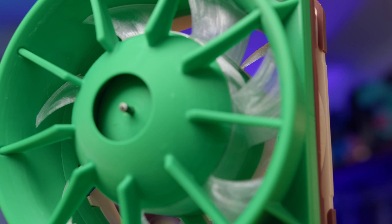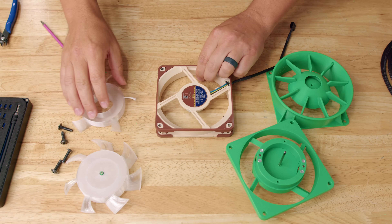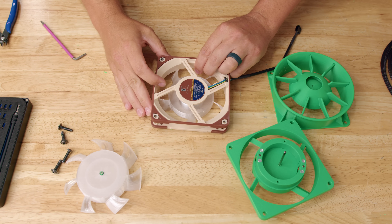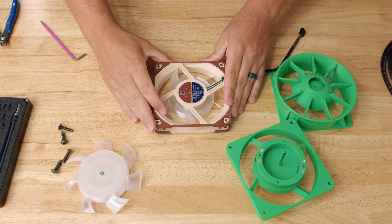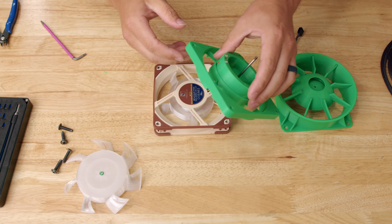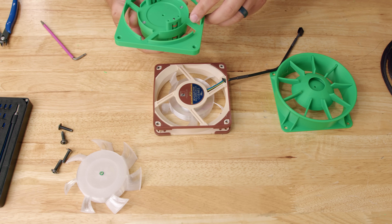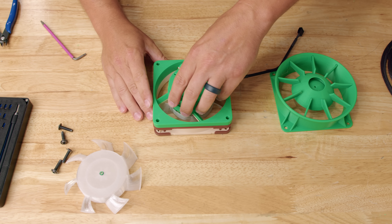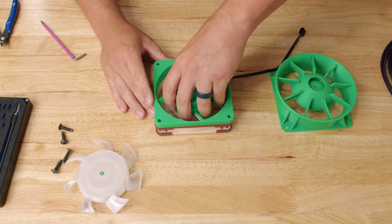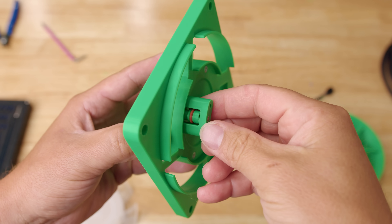The best part is that there are no belt drives, no gears — Tom didn't need any of that. The fan itself is made of many pieces, some 3D printed and others purchased and modified. The power plant is obviously an A12X25, to which a 3D printed disc is attached with a larger hub than you'd normally see, and inside that hub it is basically hollow. After installing the fan disc, the fan is built on the backside of the A12X25. The next thing to go in is a spacer plate with a drive assembly attached.